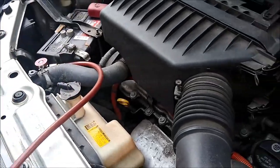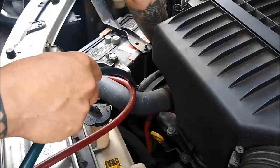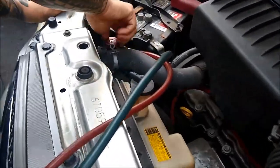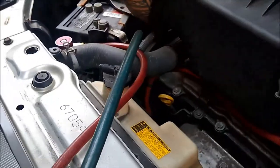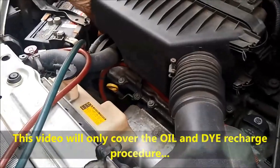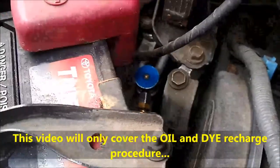As you can see on screen, we are installing the high pressure hose. This may be basic for a lot of you guys that do this every day, but it's not for 95% of the population that has no idea. Basically, you have two hoses — the high and the low. By connecting the high and the low, you can charge it either through the high or the low or both, with the engine off. The engine cannot be on when you do the charging.